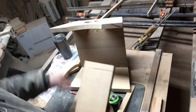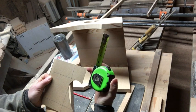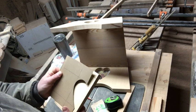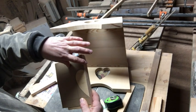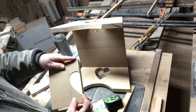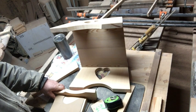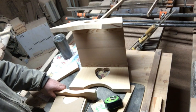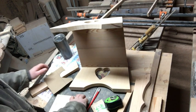Here's a random end cut - let's say I wanted to drop down from the top of the board two inches, which is this measurement here. This is a two-inch square from the top of the template down to where that line is. All I have to do is line up the top of the template to the top of the board and the edge of the template to the edge of the board, and likewise on the bottom. With the board up against a straight edge I can hold it down and trace my line, then take it to the bandsaw and cut it out.